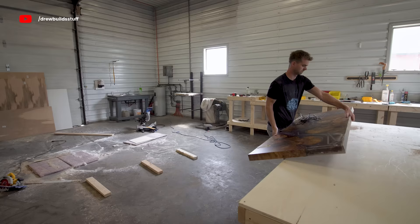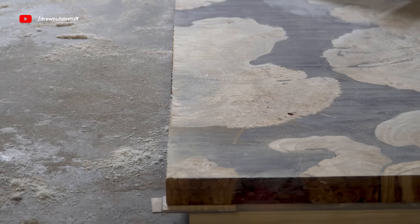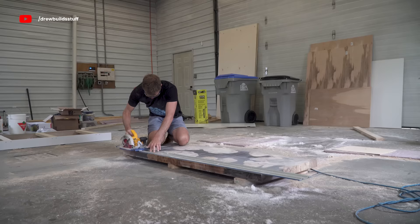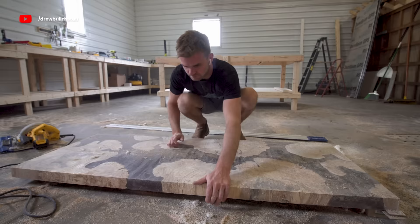I solo lifted this tabletop — which weighs about the same as me — over to the floor, and I'm going to cut all the final edges around the piece. I just used my Kreg track saw jig again along with a regular old circular saw and cut the pieces as straight as possible. The slab was still too thick for the track so I just took the track away and made a quick second pass with just the circular saw — the cut was already 95% of the way through so it was automatically guided by the path of least resistance.